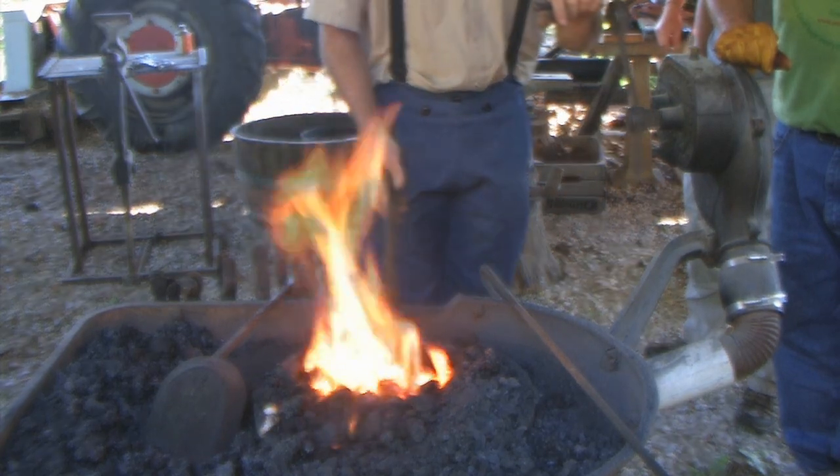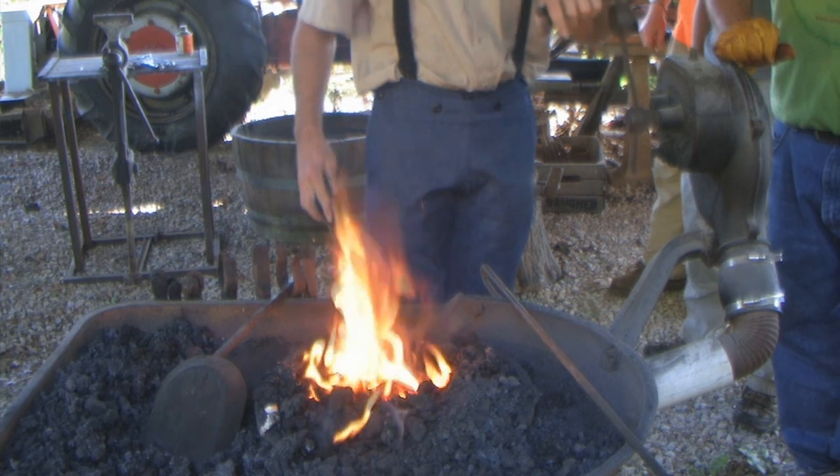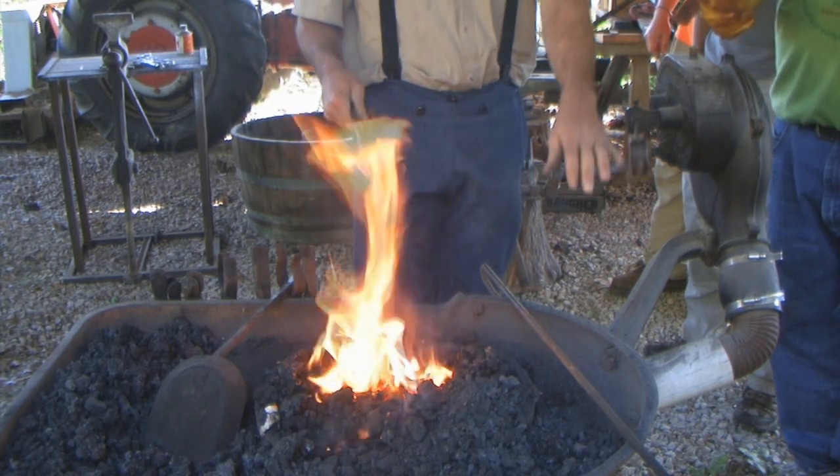On milder steel you can get it brighter, but when I want a hammer to get it really mild and malleable, I want to get it just about ready to start throwing sparks — it works very easily.